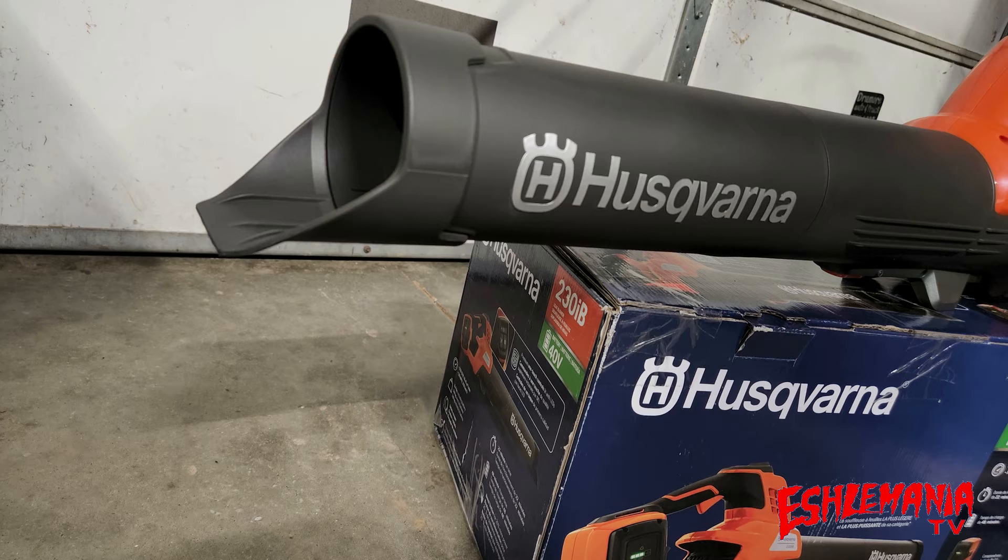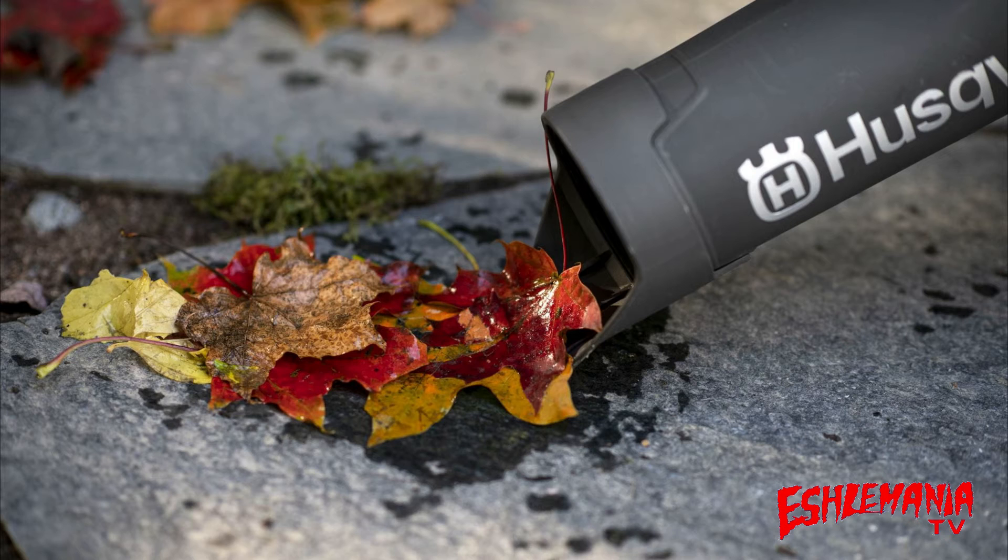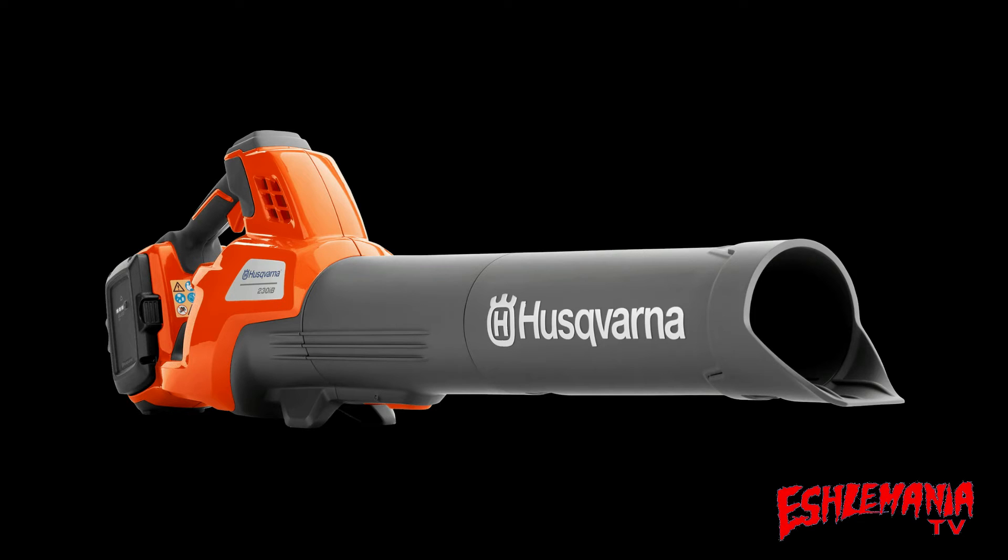Out at the end of the blower tube, you'll find a scraper blade — something you don't see on any other leaf blowers. A lot of people look at that and ask what it's for. The reason is because sooner or later, any of us blowing leaves off a sidewalk or driveway will poke at something stuck with the blower tube — it's just what we do. So Husqvarna incorporated a scraper into the blower tube so that if you have something that's not moving, you can actually scrape or prod at it with that scraper blade to loosen it up and then blow it away. You can also use it in the cracks of your sidewalks, which get packed full of dirt and debris — scrape them out and blow the stuff away as you go. Just a little extra plastic on there and it makes a world of difference.